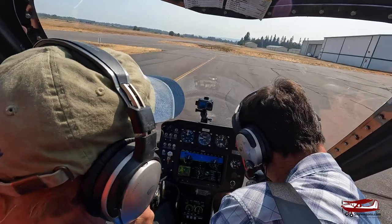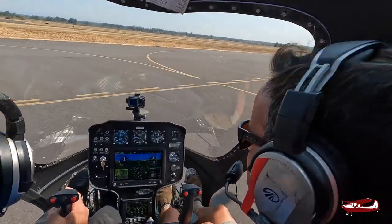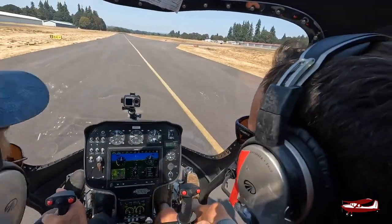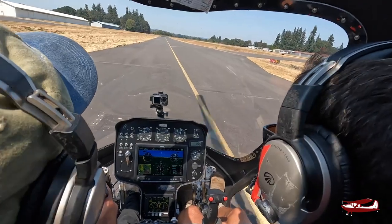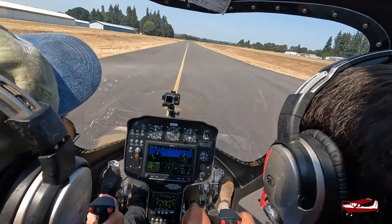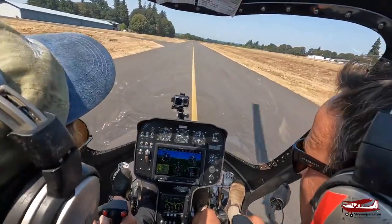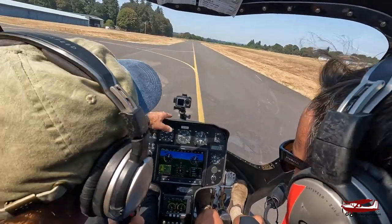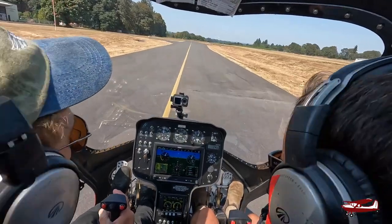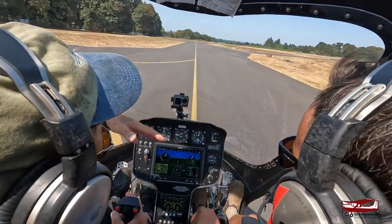The stick comes all the way back and a little forward — that way I can always feel the flap. I've got the stick back and taxiing, unlike a lot of other brands. They don't do that because the nose wheel is connected — it's too spooky to do both, having the rotors turning while taxiing around. There's going to be a brace here for the window — I haven't put it in yet. I'm going to put it in in case of a rollover, so the panel becomes a rib from the frame to the top — keeps it from being a trouble zone.